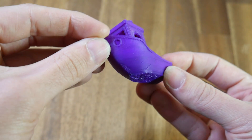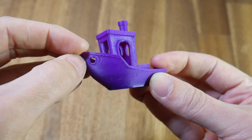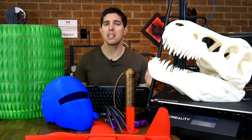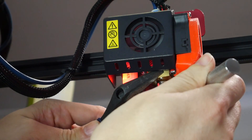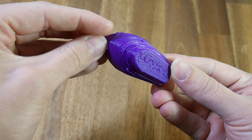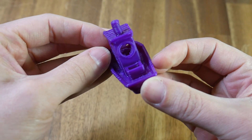This is a fairly good Benchy, with some cooling issues underneath the front and some layer change zits courtesy of Simplify3D, but not much else wrong. But this printer is big, and you get it because you want to print big things. Therefore, this was the time that I installed the included 0.8mm nozzle. I started by making some comparative Benchies, this time with 0.4mm layer height. After a few failures, I got a pretty average one. This big nozzle is just not suited to these tiny little things, but I wanted to do super large prints, and therefore I had enough to move on with.